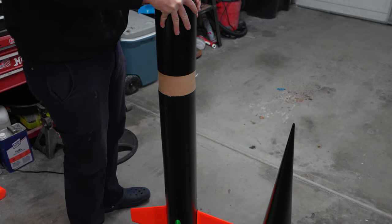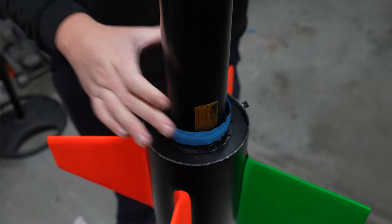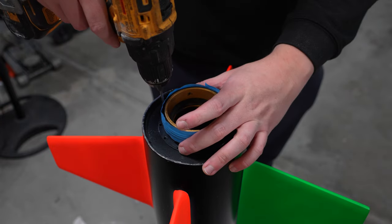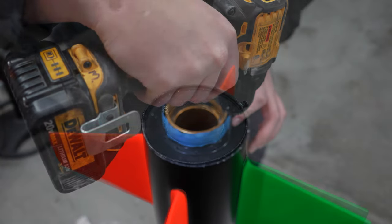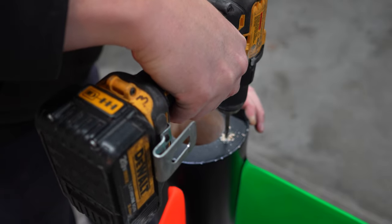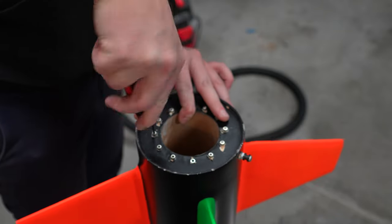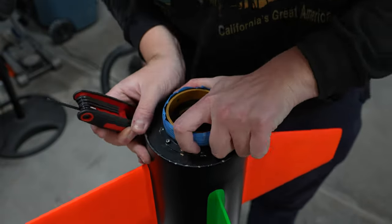After I got a nice fit on the lower section of the rocket, the next step was to install the AeroPack motor retainer. When going into the wooden rear centering ring, I use the provided barrel nuts to ensure we've got a good solid mount. I use a motor case to line it up, drill one hole, remove the whole assembly, install the barrel nut, then drill the next hole with both the case and the first screw in place. Then I remove the whole assembly again and install the second one just to make sure we've got it properly aligned. From there, I simply drill out the rest of the holes, remove the assembly, and install all of the barrel nuts. I know this seems tedious, but I have misaligned an AeroPack retainer before, and it is not fun.